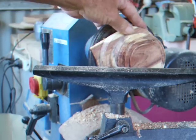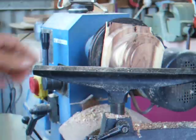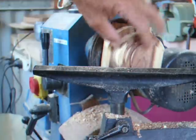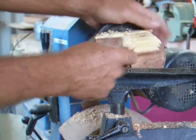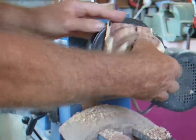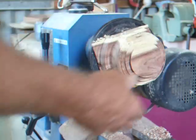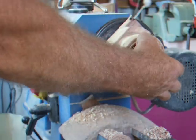That would only blunt my tool. But this wood is very, very hard, so I'm going to take that off and turn it around and hook onto that side there. I've got a bit of a lip and I'm hoping that's strong enough to put the chuck on, because I didn't want to put too much of a lip on there, but it should be strong enough. I've done this before.